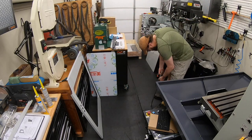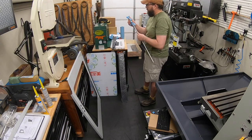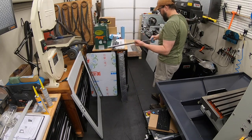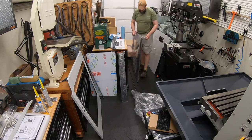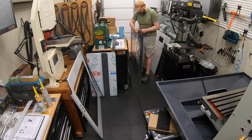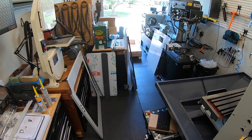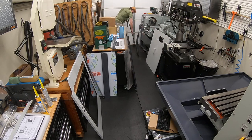The other piece I'll share is I called Tormach to understand what they recommend for putting this together in the way of a silicone or something to seal it to make sure you're not going to have leaks. And their recommendation was Sikaflex 1A. They did let me know that it is fairly permanent. So next time I move the machine, I'm going to need to move it completely assembled. So I assume that means that this stuff secures strongly enough that if you try to take it apart, you're going to be bending up this sheet metal. So I'm assuming that's what that means. But I will tell you that the color match is awesome. So I'm glad I called them and got their recommendation. What they call Sikaflex 1A in limestone color is just about a perfect match for the white. And the Sikaflex 1A in dark bronze is a pretty good match for the gray parts of the machine. And you'll see that more when we go through the assembly process on this and you'll see it all going together.